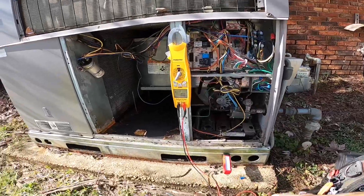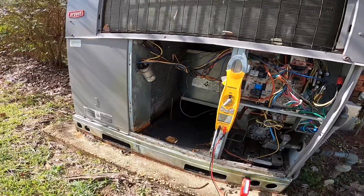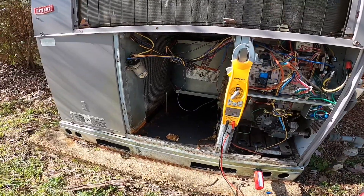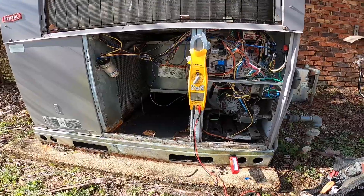In the past I have had X13 motors that will not shut off. Now you got to remember they are supplied with high voltage 24/7, so if that module messes up it can run constantly even if it doesn't have a call.